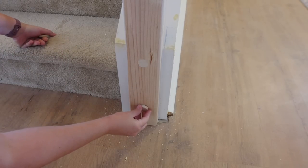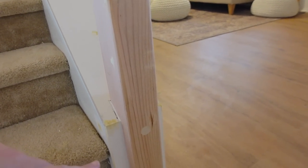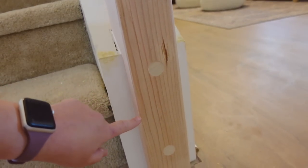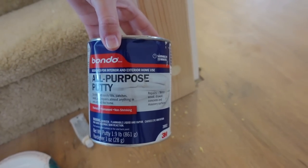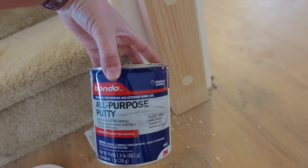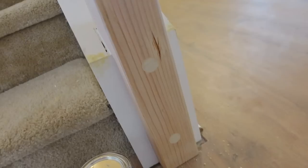So we've got all of the smaller pieces wood filled, but for these bigger sections like this, which is just a few spots, I am going to use another product that I've talked about on my channel before, which is this Bondo. It's two parts that you mix together and it dries very, very fast and very hard. So when we put it in there, we'll be able to sand it off and it'll be completely smooth.